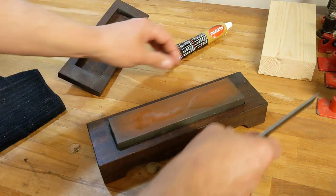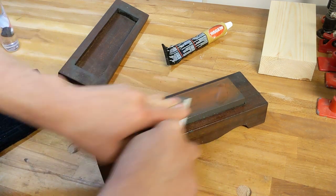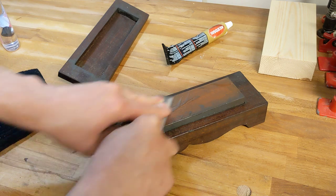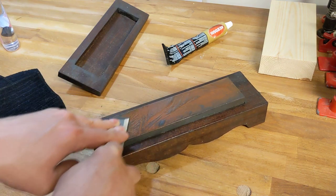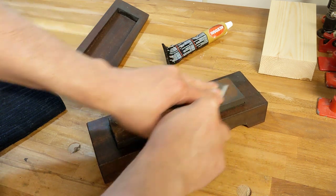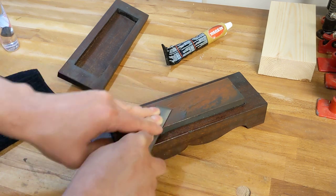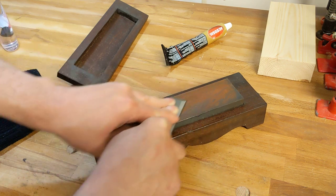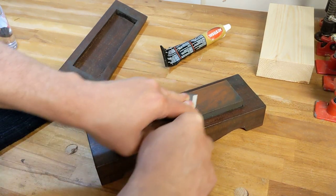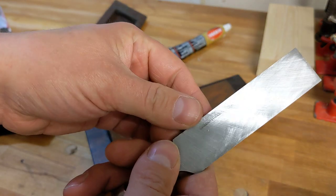This stone should get you going for what you need. All you need to do — you can hold the stone however you like; I've got a nice case but you could just hold it on a flat piece of wood with some little blocks around it. Hold the chisel like this, drop it down, then work it. You'll hear a lot of people talking about how things need to be perfectly flat. The back of a chisel isn't one of them in my opinion. What I'm more concerned with is: when I raise a burr, I can remove the burr — that just means the back of the chisel is referencing properly with my sharpening medium. I'd call that done.